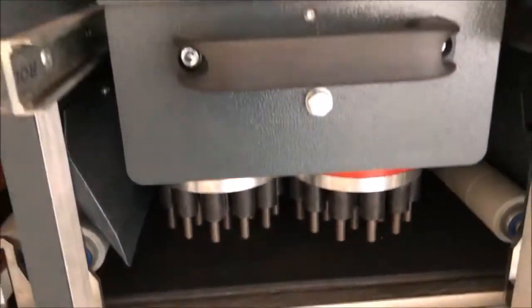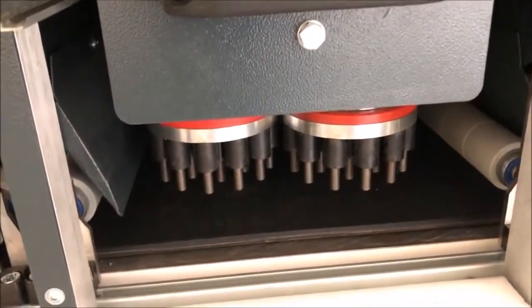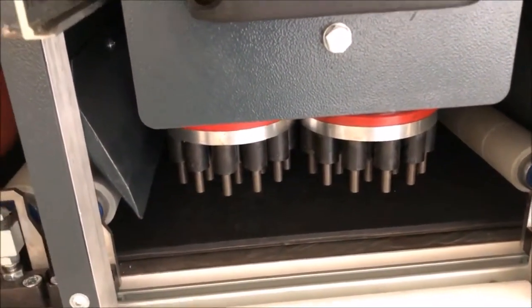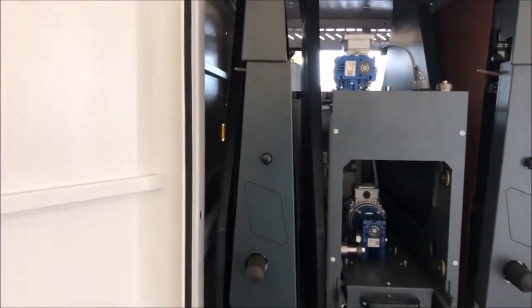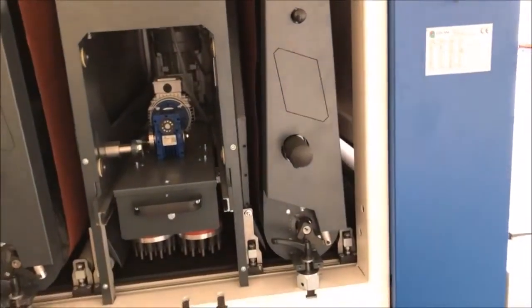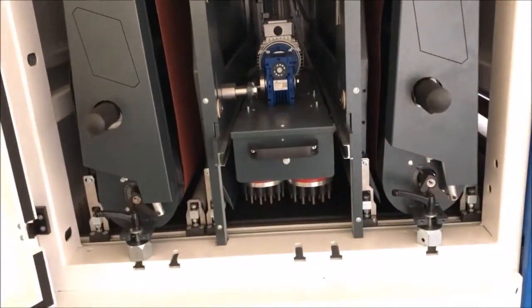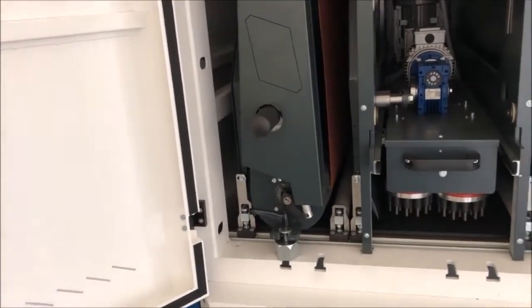We will change that to regular abrasive slash Scotch-Brite edge rounding heads. And then it has the last head to do the finish to get out the cross edge from the edge rounding. So this is deburring and pre-grinding. This is edge rounding, and this is finishing then afterwards, which could also be done with a hard Scotch-Brite.